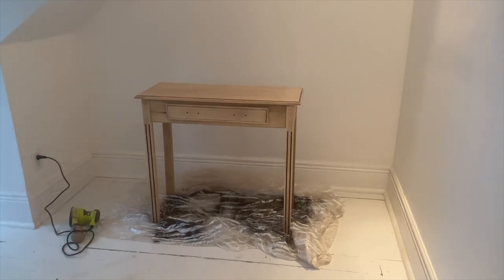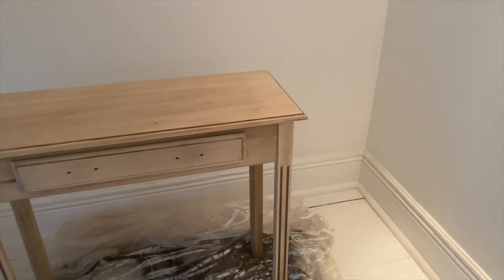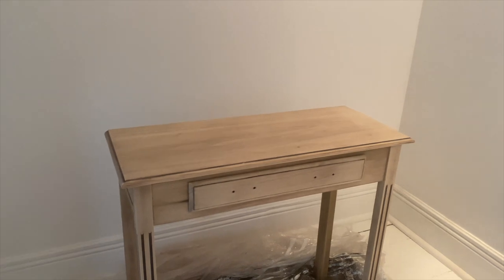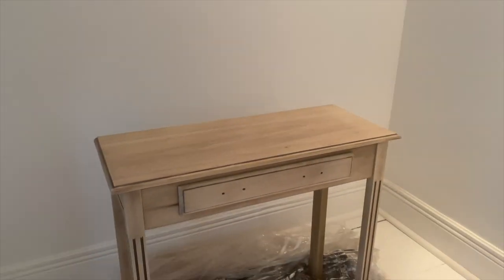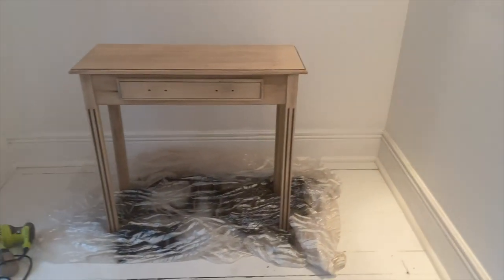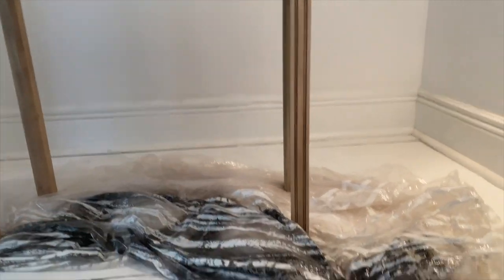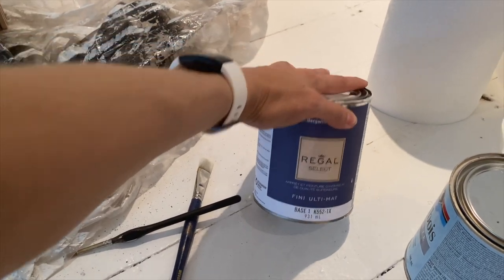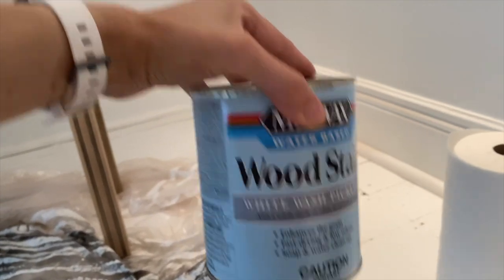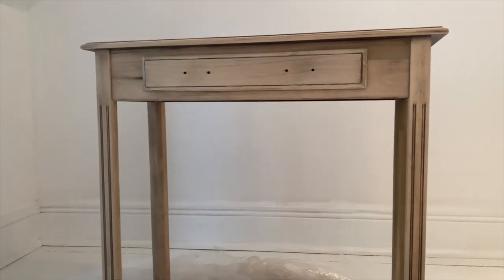So here's how it is looking after sanding. I cannot get in these like dark lines — I tried to do a bit by hand and it's really tough, so I'm thinking of painting that white as well as the other dark spots and then whitewashing the whole thing, that's kind of my current thought. So I decided in these darker areas I'm just going to use some paint — I'm just using White Dove, it's just wall paint — and then once that's done I'm going to apply the whitewash. Hopefully it should look good and should help with those darker areas that I don't love.